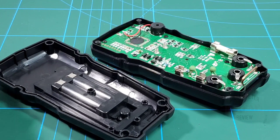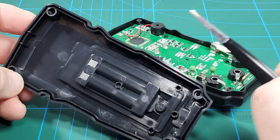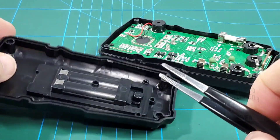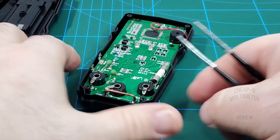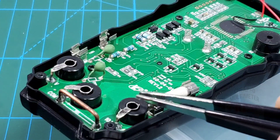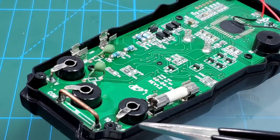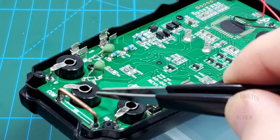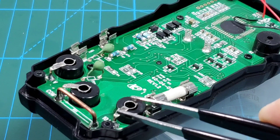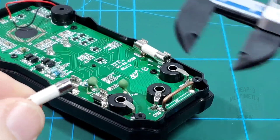Looking on the inside — no surprises. Reverse side has no shielding, nothing else much going on. We've got our connectors for the batteries and a little bit of blast protection, but at the end of the day nothing special. The input connectors are the split variety, but the actual metal filament is a little bit thicker than usual — a good thing. The soldering job has nice thick blobs, which might not look pretty but is actually a little better than your typical cheapo for split-variety input jacks.